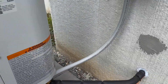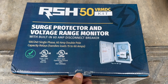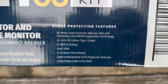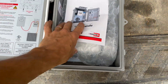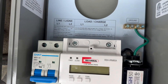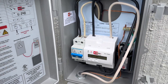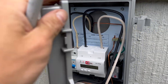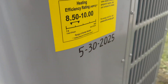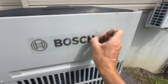Just doing a quick check on everything at the outdoor unit. We're going to have a look at this RSH-50 disconnect — this thing does voltage monitoring and has a surge protector in it. A lot of the issues we have with control board failures on any inverter is the fact that it's riding at low voltage or high voltage for too long. We use this RSH-50 disconnect by RectorSeal — an awesome disconnect that monitors the voltage, shuts it down, and gives you a two-minute off delay if it's cycling on and off. We absolutely love it — it really protects the unit.